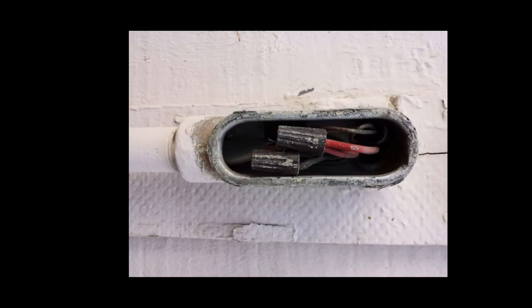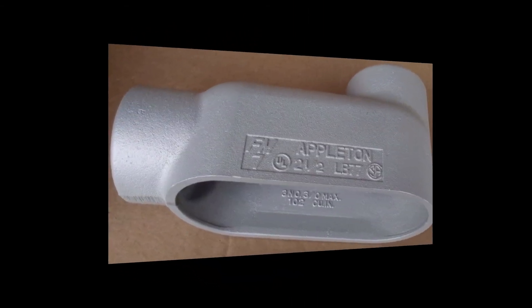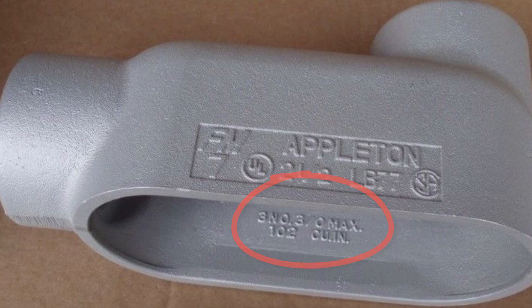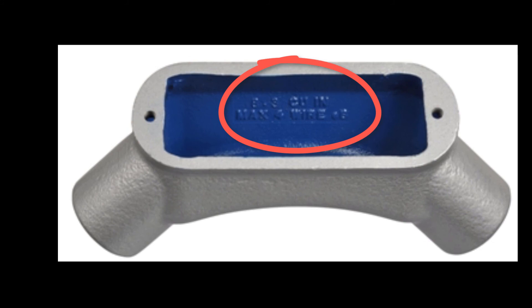There's a final point I want to make. Sometimes instead of just pulling wires around corners, you use these things for splicing wires. This picture shows the idea of splicing wires inside of a body, and there's a rule you've got to follow: the manufacturer must have stamped onto or inside the conduit body the volume of the body's interior. Those are the only kind of products that can actually be allowed to have splices made inside of them. Here's a nice example — this is an LB, and you can see that the manufacturer has stamped inside the volume of the cavity of the body.